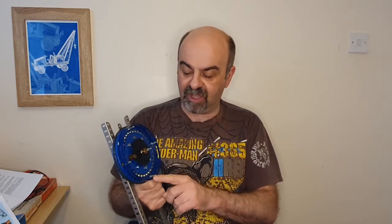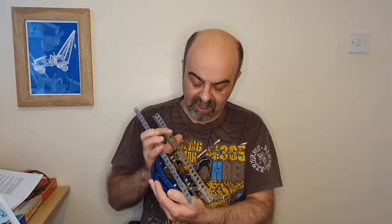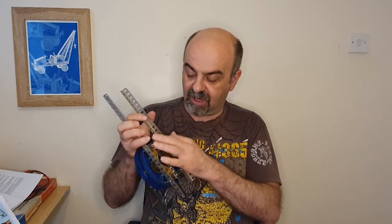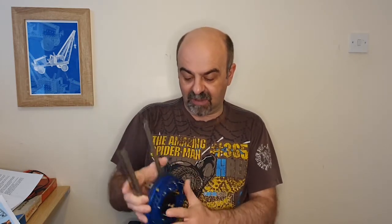The other thing that arose was I found I'd put these in the wrong slots — looking at them from above, these are the adjusted versions now in the right holes. I've also got a bolt of the wrong length, but I've moved the bolts around. I also hadn't realised how the bearing worked and that it was going to move on these circular girders up here. I had to slacken off these bolts a little bit to get some movement in the bearing because it was just so tight it wasn't moving.